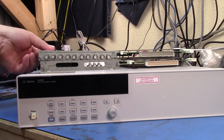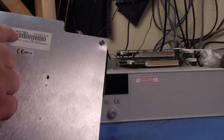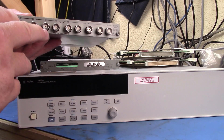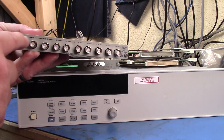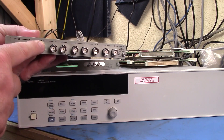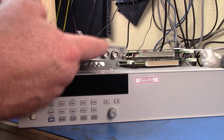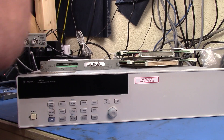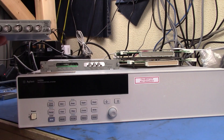The top one here is the 44472A, and it is a VHF switch - a 4x dual switch. Basically it has a common port and then four switchable ports. You can only have one connected at a time, so you can have one source going out to four devices and select them sequentially, or four devices feeding one source selected sequentially. These units enable you to scan as well, so you can tell it to scan all its inputs, automatically switch between them, read them, and send you the data.